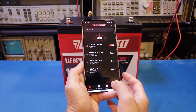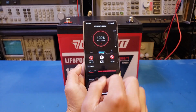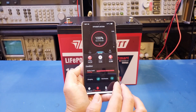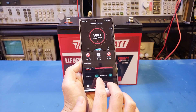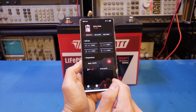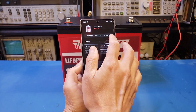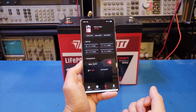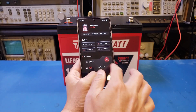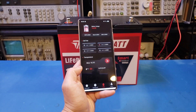Let's click on the battery and see what we've got. The battery is currently fully charged, with a measured voltage of 14.2 volts. The dashboard shows the status — whether the battery is healthy, charging, or discharging. We can also go to the cells view, which shows the status of each individual cell. Right now, the highest cell voltage is 3.556V and the lowest is 3.546V — a 10 millivolt difference, which is typical after balancing. We also have battery temperature being monitored, which is very good.